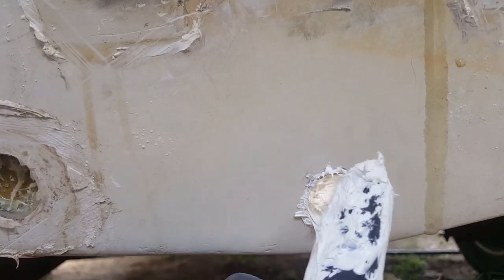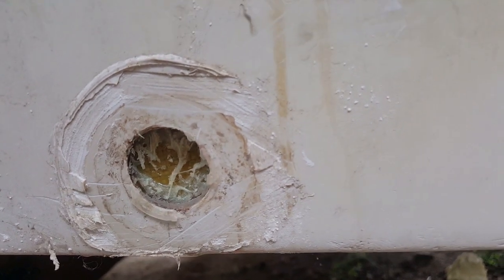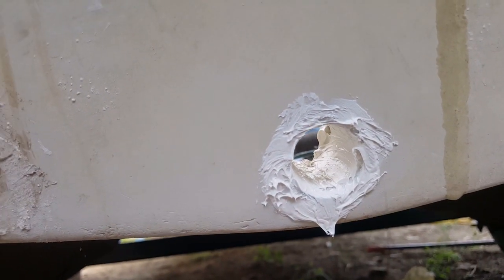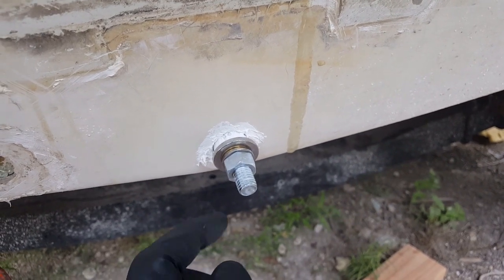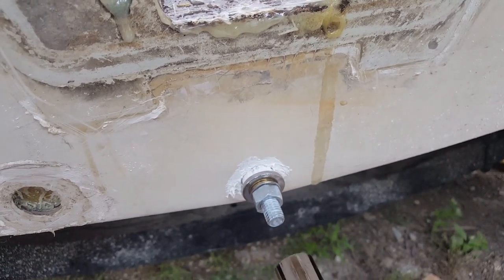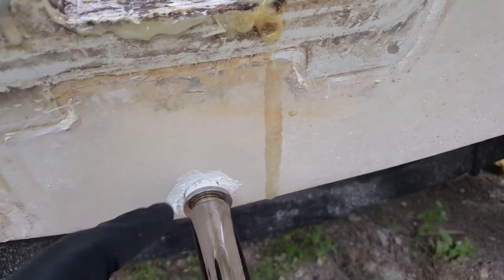You can put a little dab around that area as well. We'll clean this all up afterwards to make it nice and presentable. Now let's go ahead and install the one-inch drain. Get the flaring tool installed — it's pretty easy. You'll make a mess with PL Marine all over the place, but that's good — you want plenty of coverage. Put the three-quarter socket on one side and the crescent wrench on the other, then start tightening it until the flare starts doing its thing.